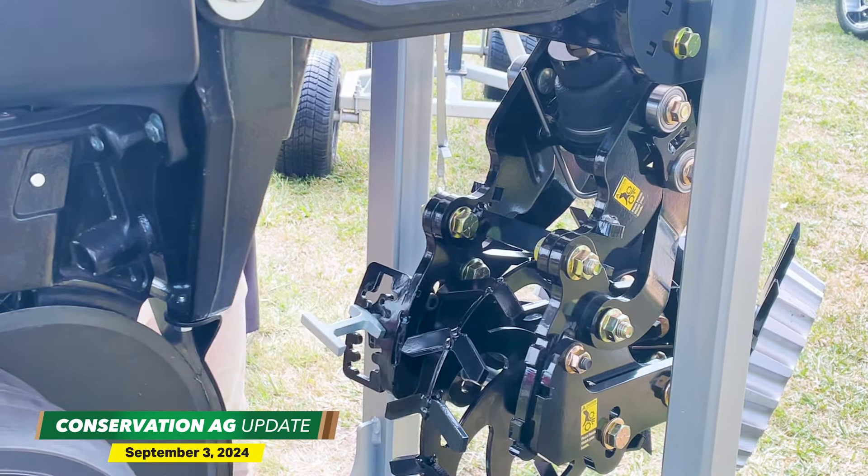Ag tires, when they are in the field, deflect — and soil deflects too. That's exactly what they're replicating at the lab with the artificial soil. The advantage is that it's a repeatable test. They've been using the same consistent artificial soil for almost five years, measuring since 2019 every three years, and its mechanical behavior is consistently the same, giving variability of less than four percent in footprint measurement. Compared to a flat plate, there's about an 80% difference in shear area because of the malleable surface and physical properties of the tire. And because it's the same artificial soil every single time, you can repeat results and always have something consistent.